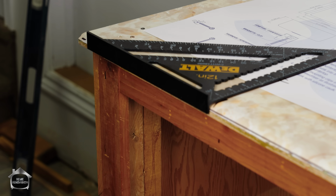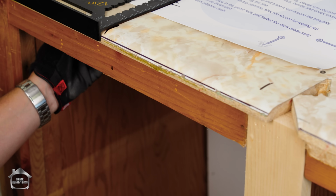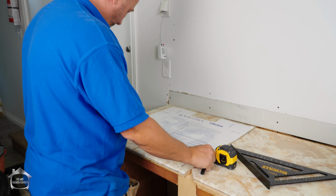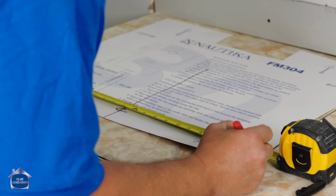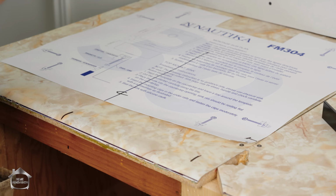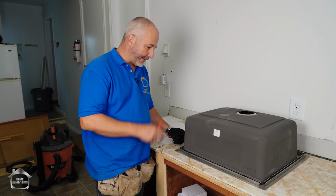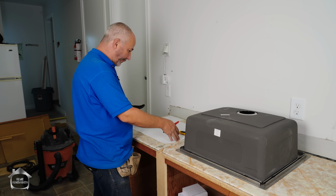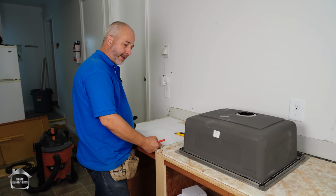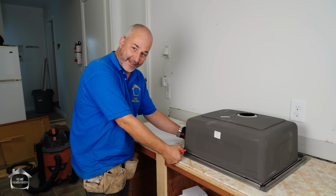Whew. Wow, this really is almost too perfect for the hole. I wish I had options, I would have got something a little smaller. So I got 22 1/4 inches inside. Yeah, I knew it. This is 22 5/8. So I'm gonna have this much material underneath that's gonna have to be removed. Not happy, but I have to change my entire plan and put the sink in the middle. At the end of the day, anything that I try to do to fit it over this space, which was the original design, is gonna leave me with a structurally compromised cabinet. I'm building a tile countertop after all. I can't compromise the cabinet.